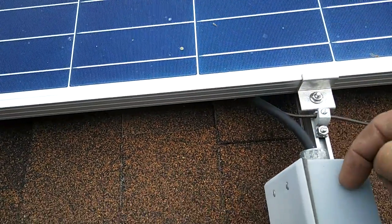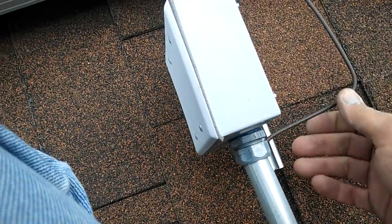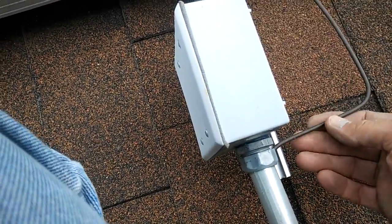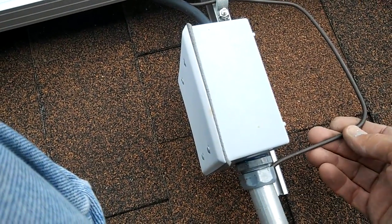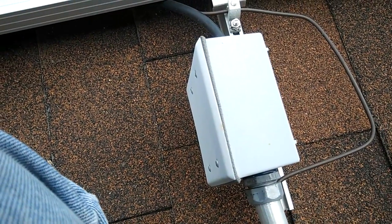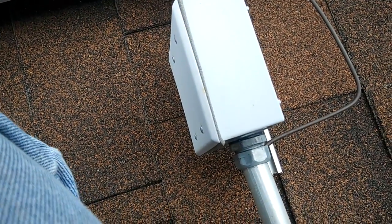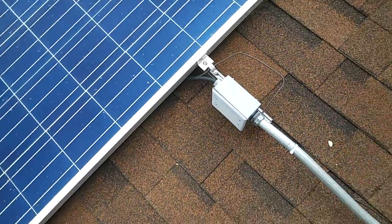But where you go into your box, tie in your box, the conduit, the ground wire — I could have put it inside, the inspector said, but the plans said 'free in air ground,' so I just went with what the plan said because I didn't want to argue with inspectors. And of course you signed it right off, first time.